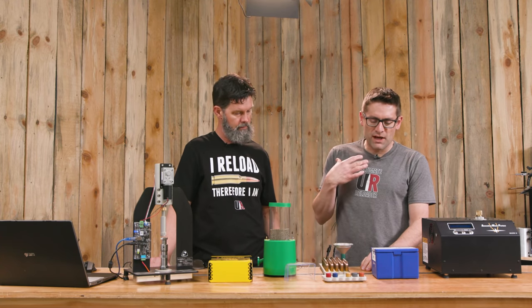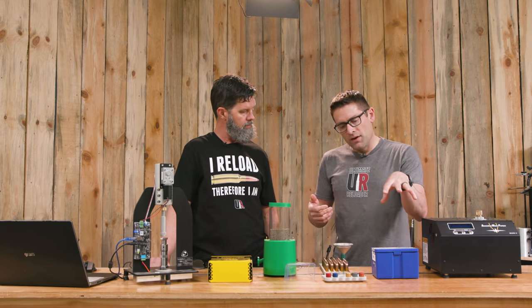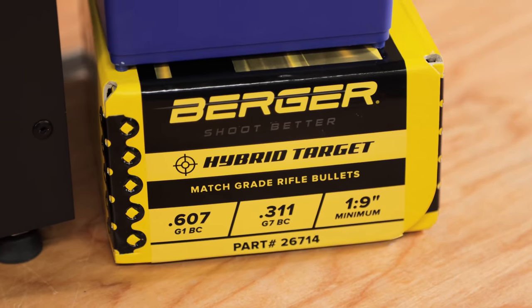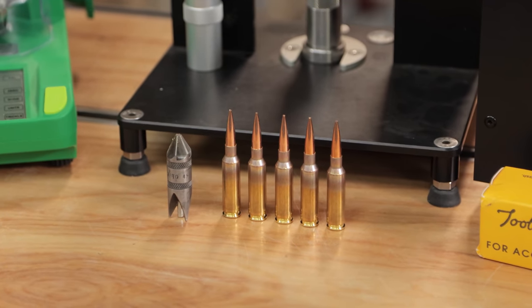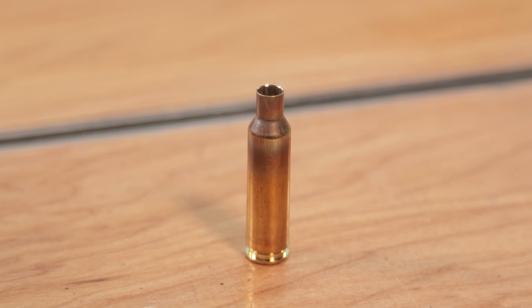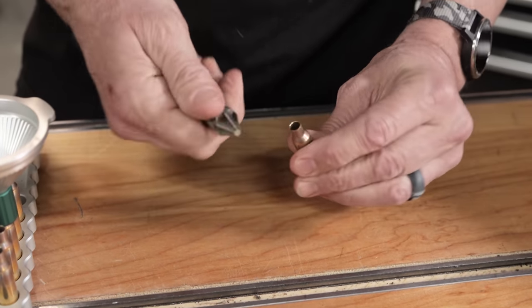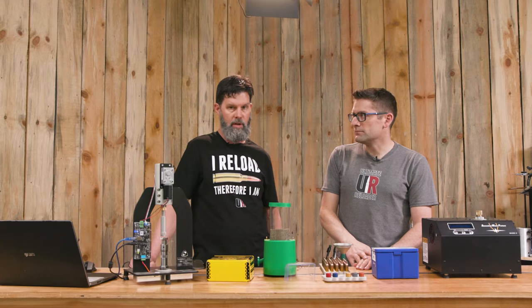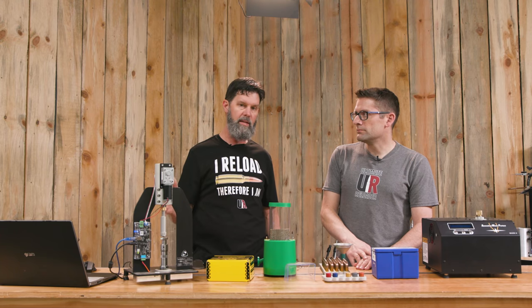I've been putting together a strategic load for some rifle build stuff we're working on and some other projects. That involves the Lapua 6.5 Creedmoor case and the Berger 140 grain hybrid — one of these great performers we turn to. Travis has put together a process where we can look at the single factor of chamfering the case mouth to see what that does for bullet seating depth. Now, we do know that chamfering is a nice thing to do — it's not going to shave the copper jacketing off the bullet — but we want to see what it does for the seating neck tension pressures.